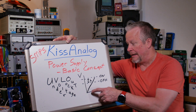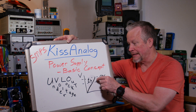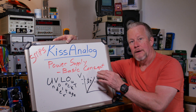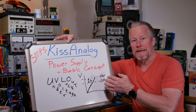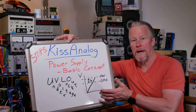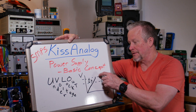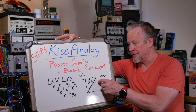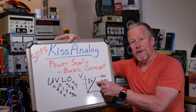In this one, we're going to demonstrate how we turn on. We've got voltage here and time here. I'm going to crank up the voltage and we're going to see when it turns on. It'll turn on at some voltage value, and as it turns on it'll draw a current, and there'll be some voltage dip at the input - most likely just because of the components, even the connectivity, the copper traces and wires, things like that. Even if it's a small dropout, you don't want it to go on and off and bounce back and forth along this line and never turn on. So they build in some hysteresis - a difference between the voltage at which it turns on and the voltage at which it turns off.